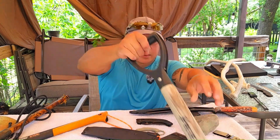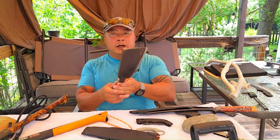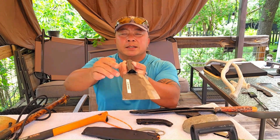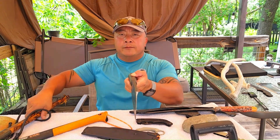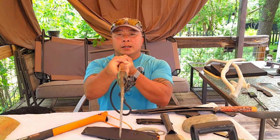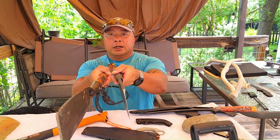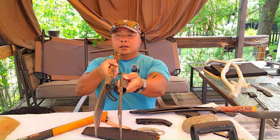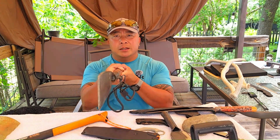So a lot of those, like the UK billhook and the Thai machetes in general, you see the bias, it's more biased to one side this way, and it's also more biased this way, right? So if I'm wanting to have an efficient wood chopper, it's the same as with the shovel. I need the handle to be centered with the blade, okay? So if you look at these two, you'll notice that the AX-VEL blade is more centered than this blade. Okay, that's why I chose it. It wasn't just random. Okay, so there's a lot of thought into this.